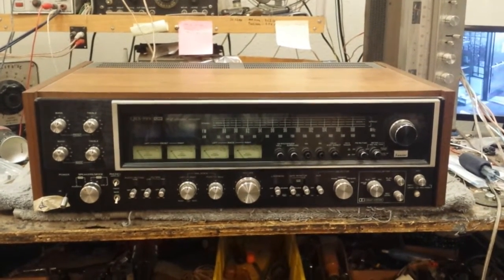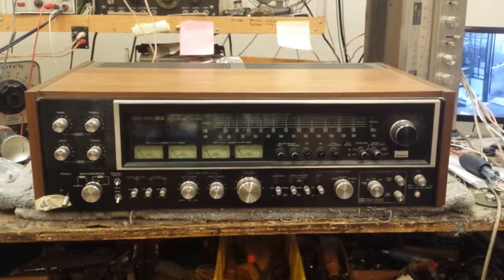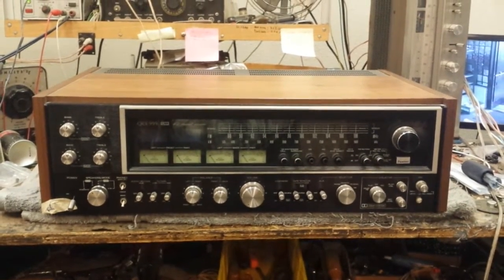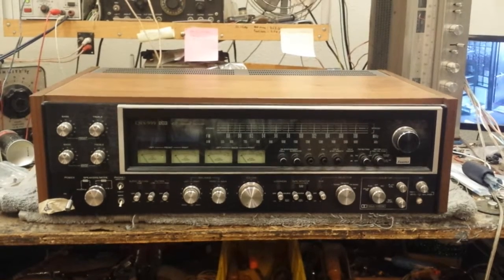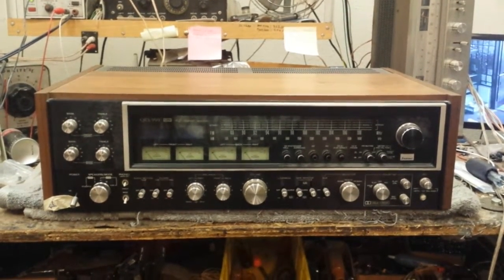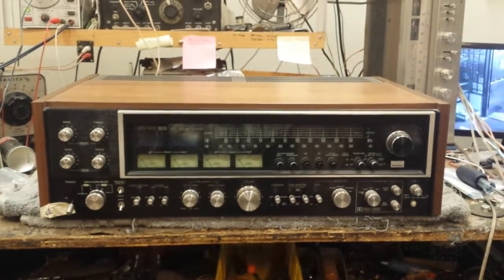The main complaints are usually channels drop out, meters don't function properly, machines stuck in protect mode, and a few others which may or may not be of importance having to do with the Dolby circuitry which most people don't use. This was Sansui's top-of-the-line machine for its time. They were exploiting probably the most advanced technology in four-channel design, as this machine will decode all of the four-channel formats and has a built-in CD4 decoder.